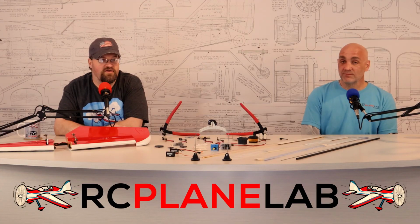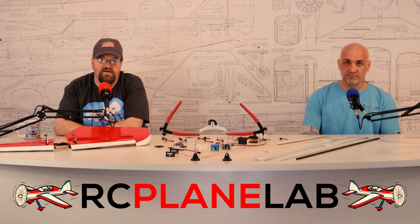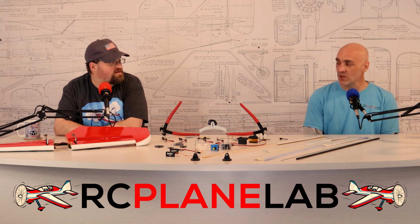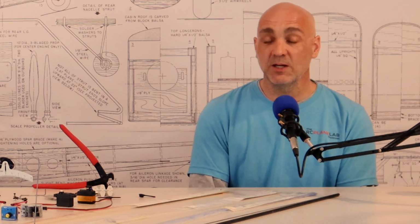It's true. So that's why, for as cheap as those servo testers are, it was a 3-pack for next to nothing, that is, to me, the only way to do it because it's so much simpler. You don't have a lot of electronics sitting out, and you're centered the whole time. And it will hold it there while you're attaching your linkages and making your adjustments. Yeah, good point. When you turn everything off, the servo is susceptible to movement. You can physically move it off of its center.